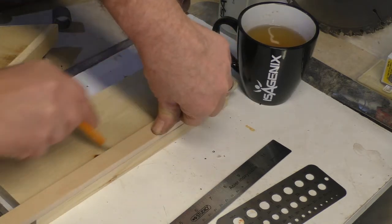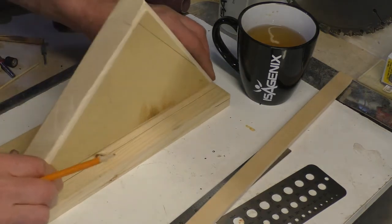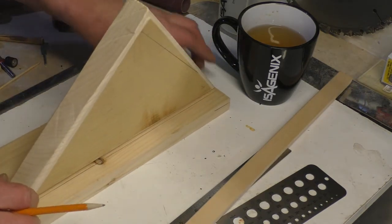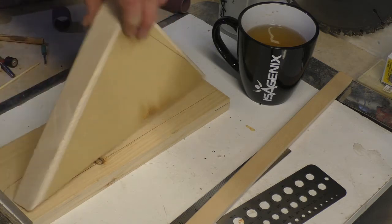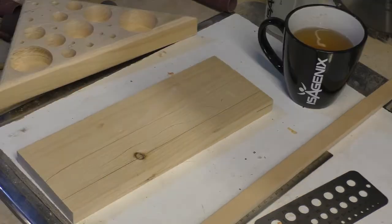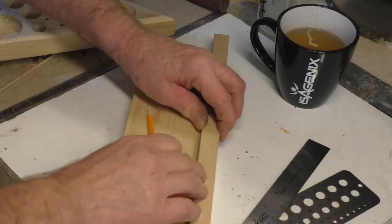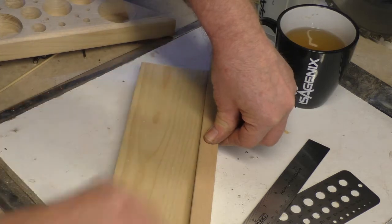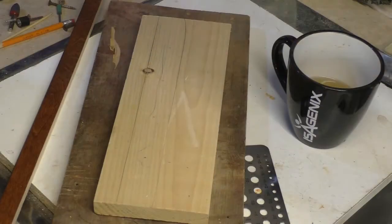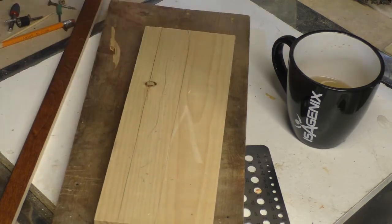And we'll put the screws in that area somewhere and the glue. And I'll also mark the top of the front. I know how and where I'm going to put it. Pre-drilled 9/64 holes in 4 spots for number 8 screws.